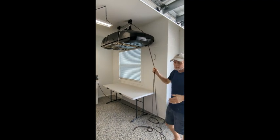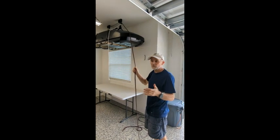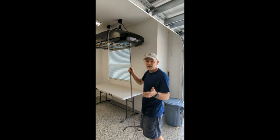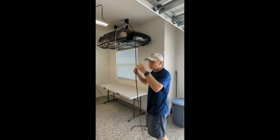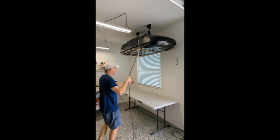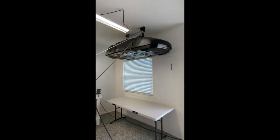Of course, the higher you get, the more difficult it is to get the brake to release — sometimes it's almost impossible. It can be dangerous because you have to get up there and actually get real close to a hanging load, which you don't want to do. So my solution is to add a hold line to the brake itself.